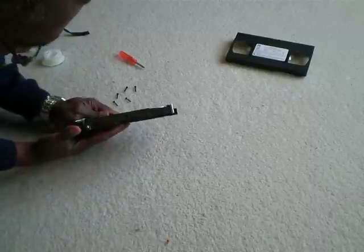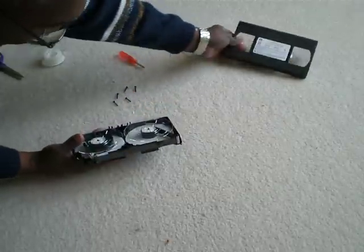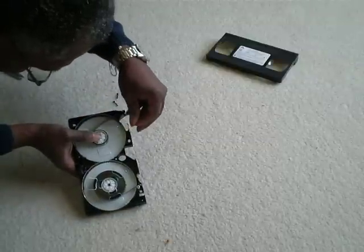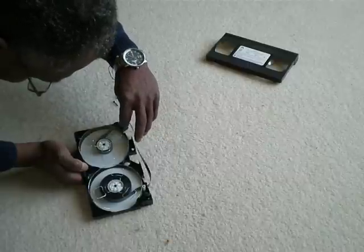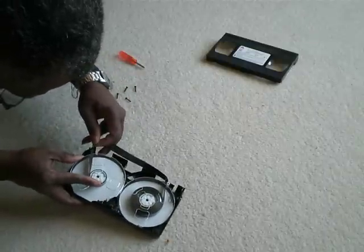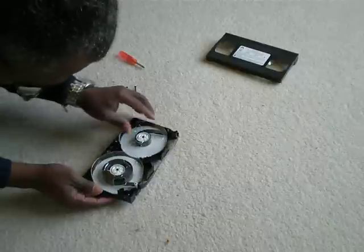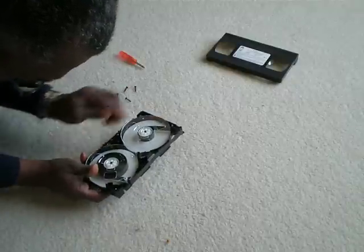Okay, now this tape has been correctly spliced together. The left side overlaps the right side. Now make sure the tape is between the guides. Let me fix this one, it's not totally correct here. Excess here, and get the tape between the guides correctly. Okay, just watch that when you're splicing the tape, the tape is within the guides as it was originally.